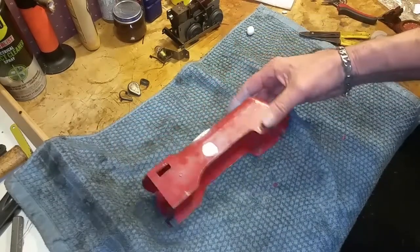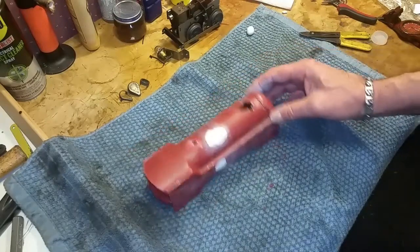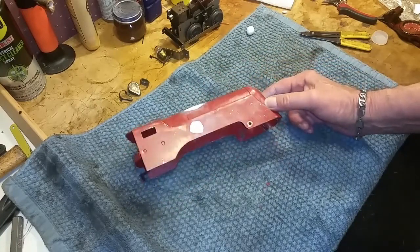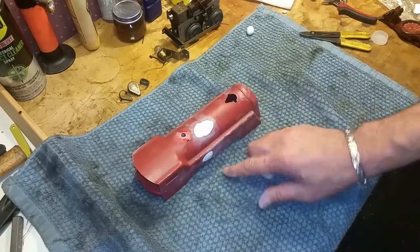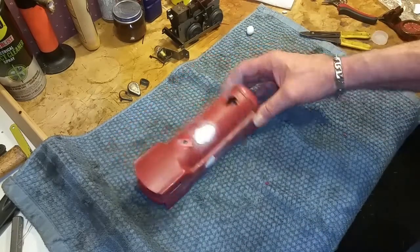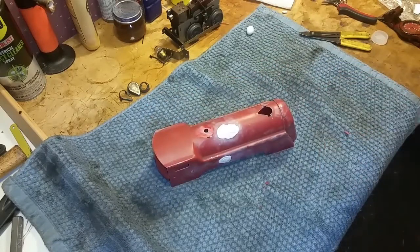I just wanted to show the quick process of converting these. It's really easy, really simple, and really inexpensive. In just a few hours you can go from a really battered up old wreck of an engine to a really nice custom Commodore Vanderbilt of the color of your choosing - white, black, red, yellow, purple, anything you want. If you want to spend a lot of time doing this, you can come up with some really neat designs. I use the two-foot rule - from two feet away this thing's going to look really nice. Tomorrow after this cures, grind it off, sand it down, file it flush, make it look as best you can on the outside so it doesn't show. Spray some primer on it, let it set, and then repaint it the color of your choice. Repaint your finials, put them back on - instant custom Commodore Vanderbilt for less than $20. If you have any questions, feel free to drop me an email at benstrainz@gmail.com. As always, thank you for watching.